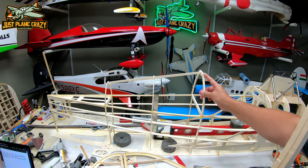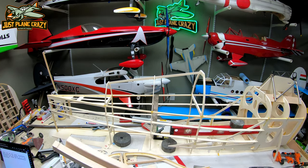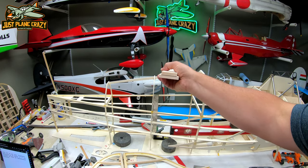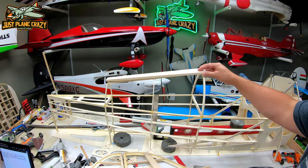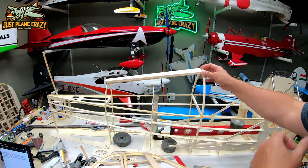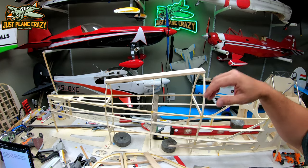This whole piece needs to actually go back a little bit because the wood is just tensioned or warped. You'll notice these two strips here for the turtle deck — one is much wider than the other. The wider one gets glued on here, and then once the rudder is on, we're going to pull this whole assembly backwards and latch it into place and let it shape that way. Let's get this thing glued down and held into place.